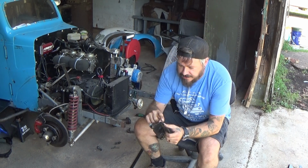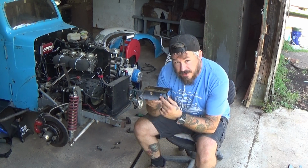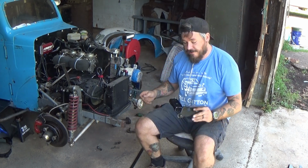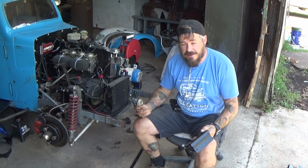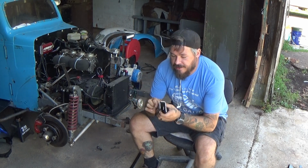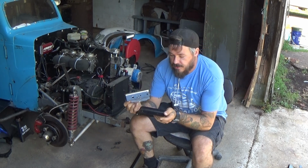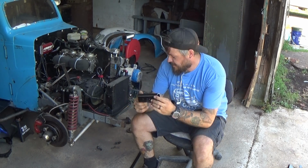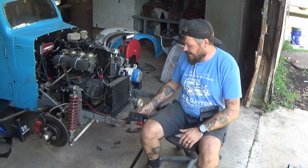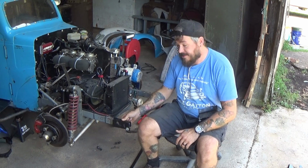What I had to do was cut out essentially this ear off of the back to get rid of these ridges so it would sit flat, and then there is a ridge on the inside of the finished one that pretty much butts it up right against the edge, so that when I install everything and have everything finished welded together, it should always go back into the same place every single time. The modified bracket, what I ended up doing was cutting those ears off, like I said. I cut down this line here, and I folded it over so it makes a pocket over the frame rail. I mainly did that all on this side, but it's nice to know that it seems to fit with very little, especially once it's up against the ridge. It fits even on this side very snugly.